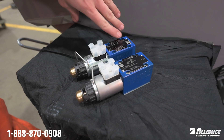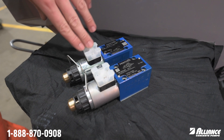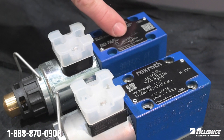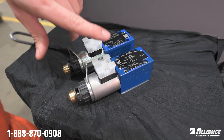Let's go over this quickly. Two patterns we're dealing with: in the neutral, non-energized position, you can see the flow goes straight through one way and back the other. Then once this solenoid is energized, it shifts over to a cross pattern — just like an X — in one way and out across.